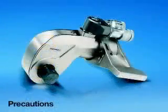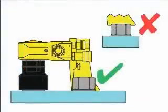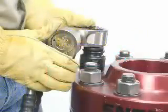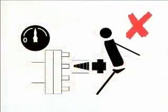Safe handling of the S-Wrench – Do's and Don'ts. Be aware of the proper location of the reaction arm and avoid improper placement. Be aware of pinch points from the reaction foot. The reaction foot can pinch your fingers or the hose if you are not careful. Do not work in line with the bolt you are tightening or loosening.